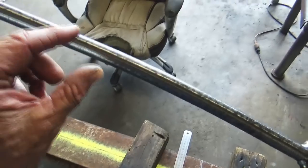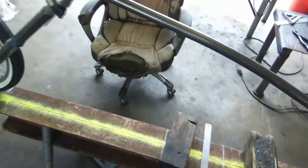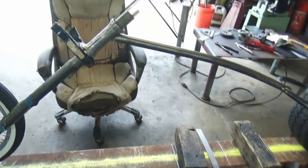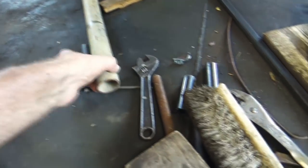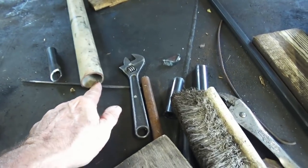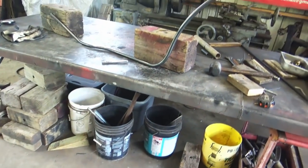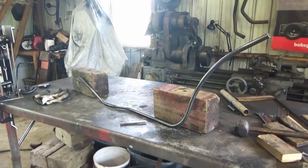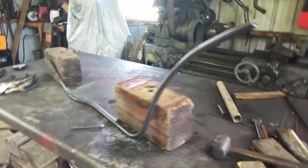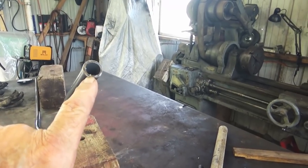None of the measurements are exact — it's not exactly three-quarter on the inside, there's no exact on the outside. When you get this pipe, it ain't no specific dimensions — it's just pipe, but you can work with it. Schedule 40. This is just pieces of chain link fence galvanized — ain't nothing but pipe, like inch-and-a-half pipe probably. I don't ever buy DOM tube — that stuff's too expensive, it's outrageous. For rat rods and stuff, schedule 40 pipe works fine. And if you want something stronger, you can get a thicker wall pipe — they make two thicknesses. This is schedule 80 if I'm not mistaken — it's a thick wall pipe.